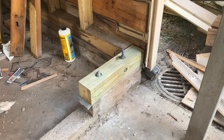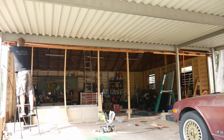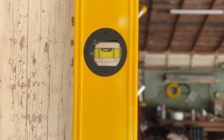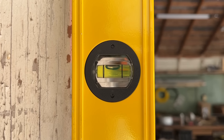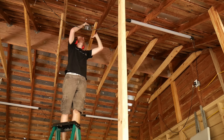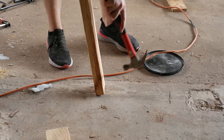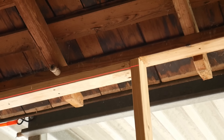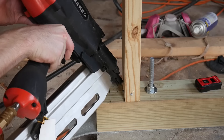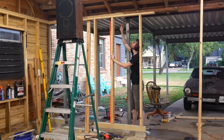I added in brand new sill plates on the other two sections, and wanted to see what a third ratchet strap would do — these are all still way undersized, but that looks pretty good. So the building might be level side to side, but the roof line is still anything but. By some miracle though, I actually had the foresight to attach the collar ties with screws on this side of the roof, specifically so that the rafters will be free to pivot about the ridge beam as I level this out. From there it was just a matter of cutting the studs to length, nailing them in place, and repeating that process a few more times until we got ourselves to the beginning of a properly built wall.